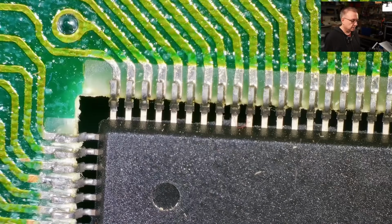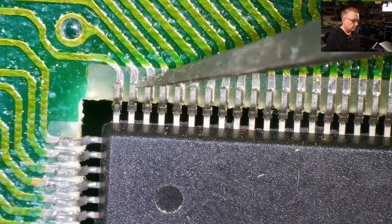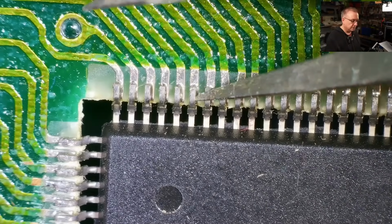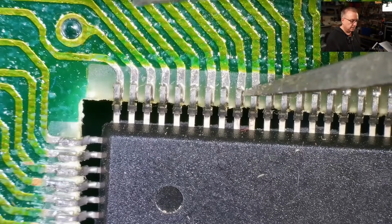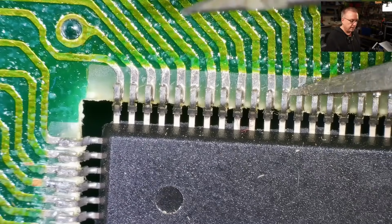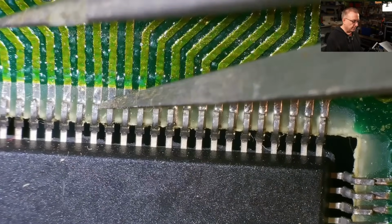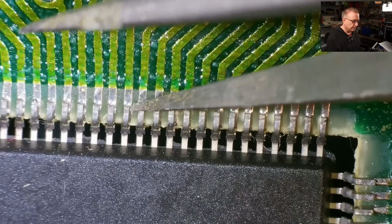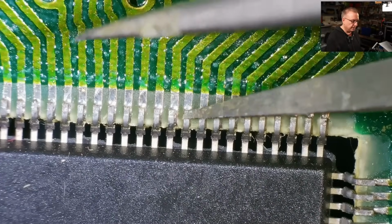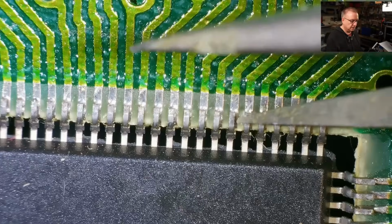This side looks good. This side looks factory actually, but this can actually catch you out because even though they look good, they could have cracked off because this is old solder, and the vibrations every time this is put down on a desk or transported somewhere will make this whole chip vibrate, suspended on here, and it will eventually just break these solder joints.